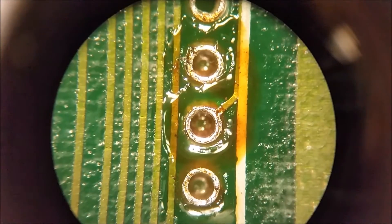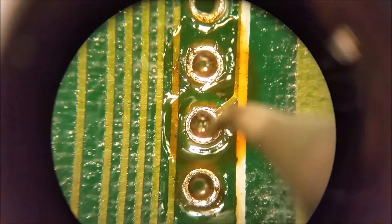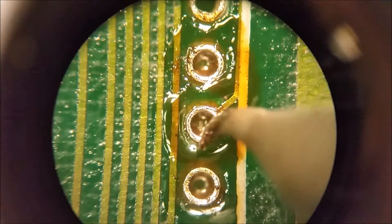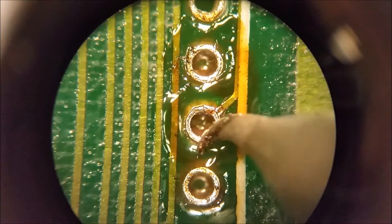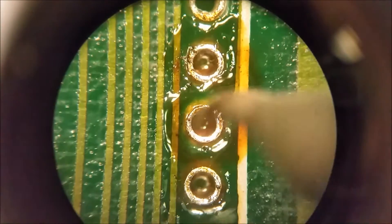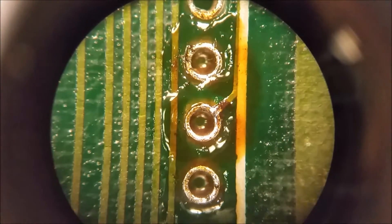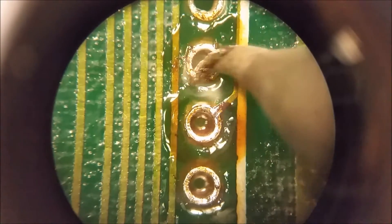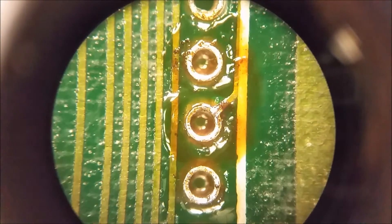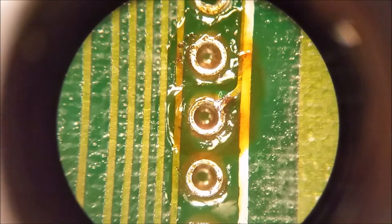You can actually see the board heat up in this area right here in the rings where it starts to turn white — that's where the epoxy is kind of gassing out. So when you heat up the board, the heat travels. That's why a lot of people don't like a lot of heat. I like to get on the board and get off. There we go — that little bit's not going to hurt anything.